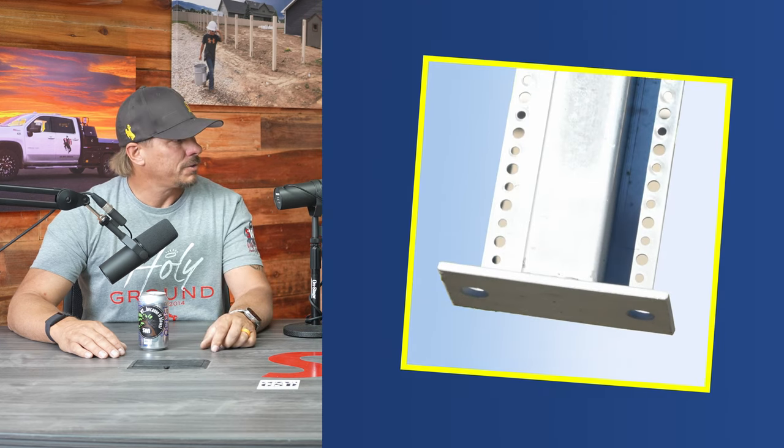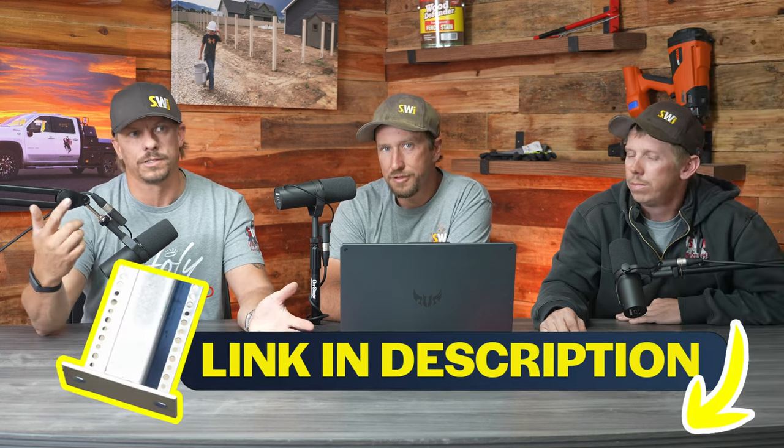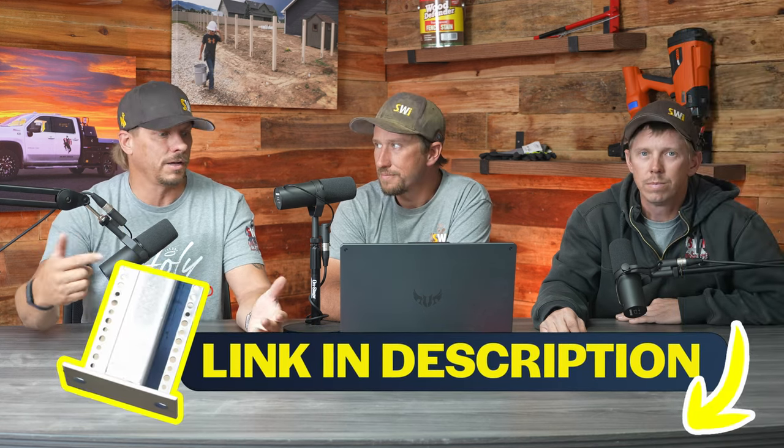I would have said a gate post up at the house — I think all of us would have done that. Then you wouldn't have had to attach to the house, and you wouldn't have to worry about the gate swinging really hard and snapping that thing off, ripping out the corner of your trim. Even if it's just bolting a post down next to the house if there's an existing sidewalk there — bolt down all day long. Those postmaster bolt-down posts that we sell, link down below. If you just need one for a latch, it's perfect — it bolts right down a couple of holes and you're done.